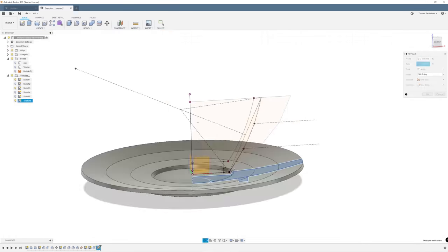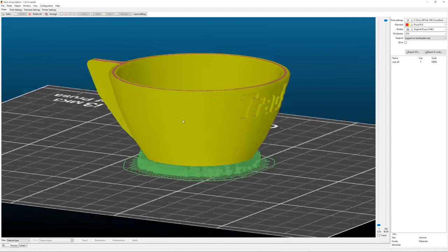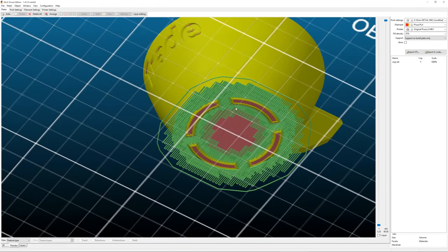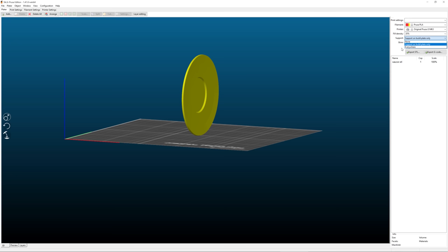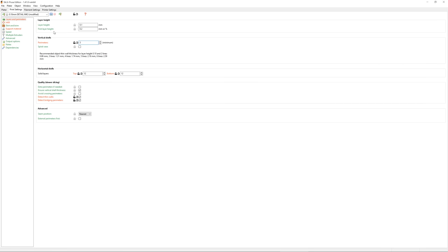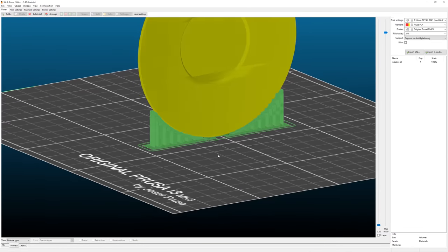I also made a very simple saucer in the same style. I'm printing the cup upright and it's been designed to have very easy overhangs, but on the very bottom I'm using support material just to make sure that bottom indent and the dishwasher grooves will print very cleanly and will be perfectly watertight. The saucer I printed standing on its side — with a large flat object like this and a very shallow overhang, you'd have the entire underside supported with support material, so that wouldn't look very good once it's peeled away. If you print it standing up on its side, only the very edge of the part is going to contact support material, and that is just super easy to clean up with a bit of sandpaper afterwards.